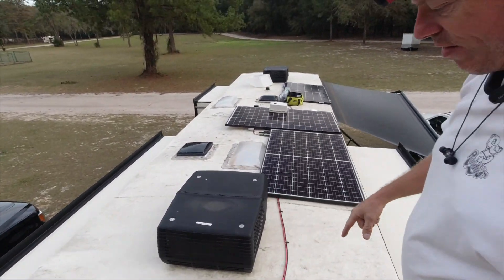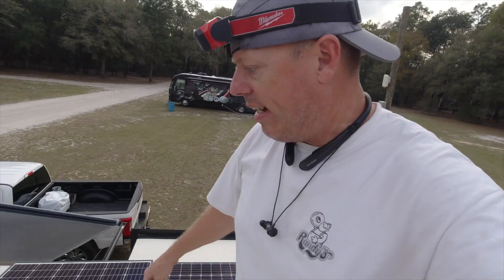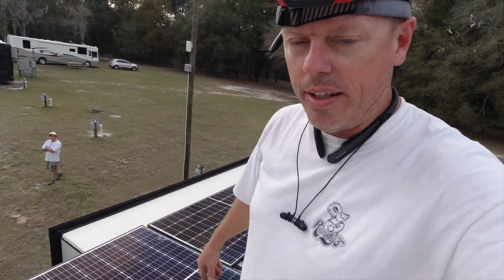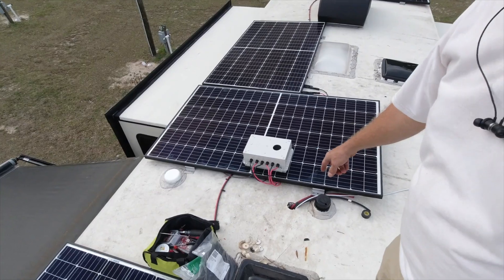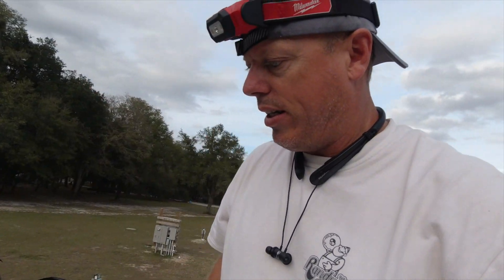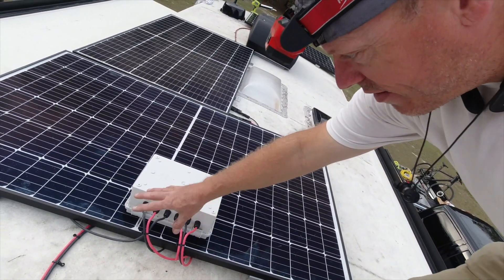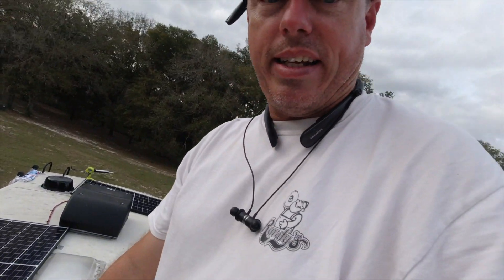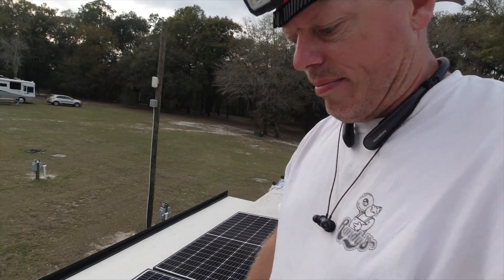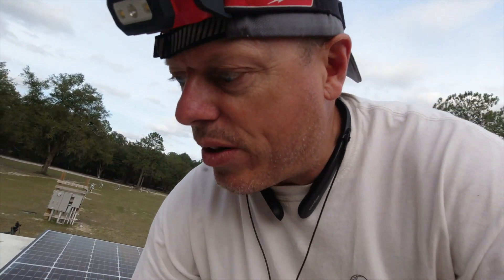One or two things I've already got wired — it just has to be fastened, including the panels. It took about three and a half hours, but I got the large gauge wire — the two-gauge — going down to get all the power coming in from the solar all the way down. I've already got the box wired; it's already completely done inside. I just needed to get the rest of my wire down. Now on the inside I've already kind of got it planned — let me take you in there and show you where I'm at.